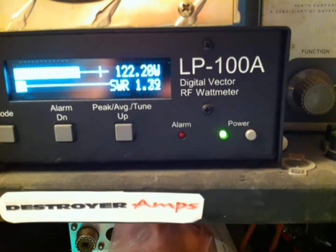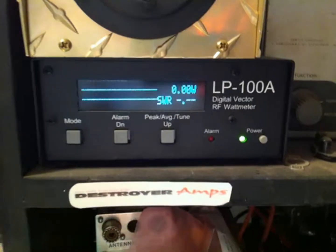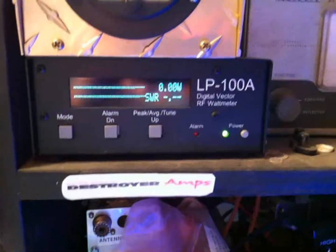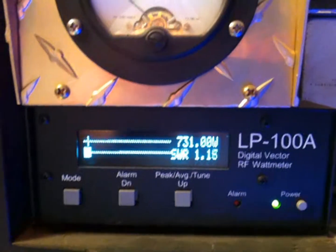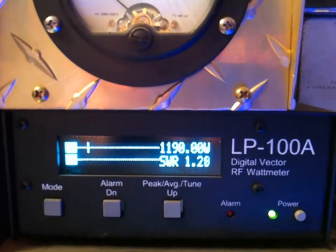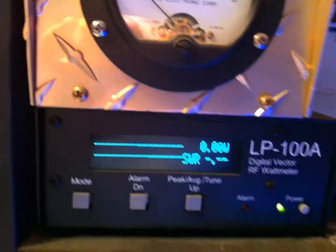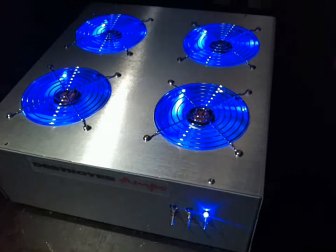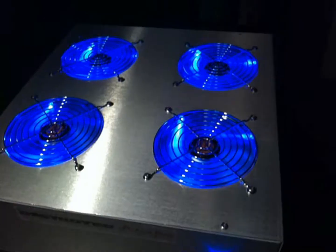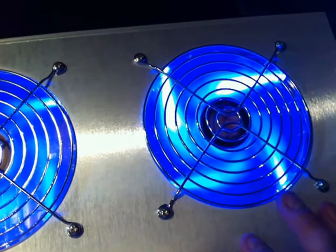Audio break up test transmitted. Reading about 122 watts drive on a good day. So we're going to put 122 watts into this 6-pill AB. Output is about 1190 — actually a little more than I was hoping for. One thing about this guy: it stays very cool, no overheating issues, especially with four fans. We've got a good section of the fans blowing on the actual power supply and the other two blowing on the rectifier and the 6-pill board.